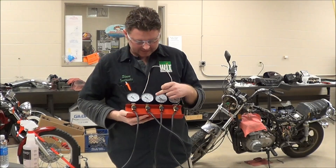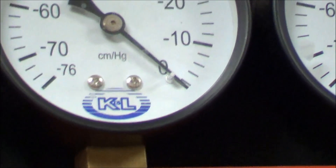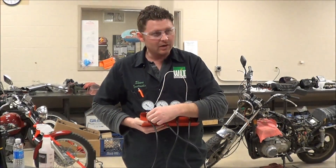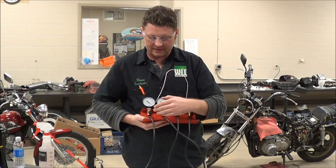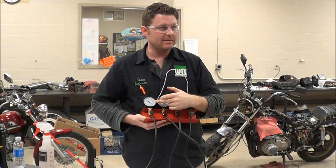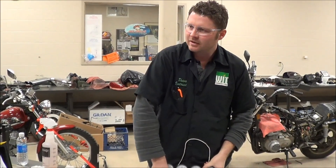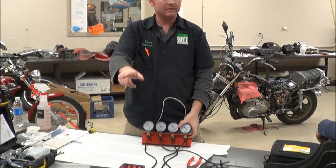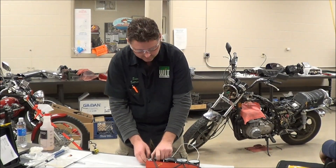If we don't create that pinch, the needle will sit and bang back and forward. Any type of gauge like this has a pin, and if that needle is allowed to bang against the pin, what do you think it does to the needle? Is that a reason why it might read differently? If the needle's bent or tweaked, we're going to have a problem. So you always start with these lightly closed. That will allow no measurable vacuum to be read. Then you lightly open it, the needle will start to dance, and you'll close it back down until you get a stable reading. Now I'm going to be the guy who doesn't know and doesn't care and crank this thing down — I'm actually taking the ball and shoving it through the hose, creating a hole or a tear.